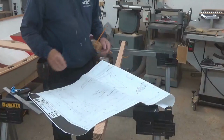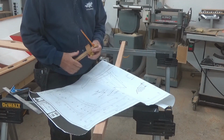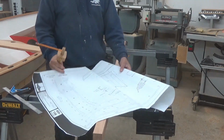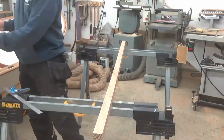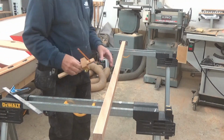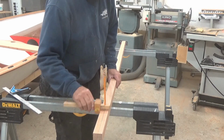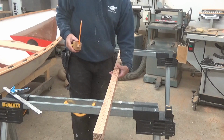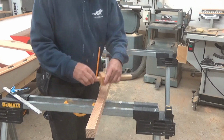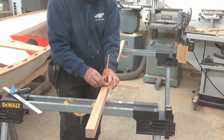I'm going to start off with the small yard, and according to the plans, full thickness in the center, and a great portion of it, is 1 5/8 or 42 mils. I need to draw a line down the center, so easy enough, we go with 21. Now I will draw this down the center of 2 sides, and then we measure out from center.